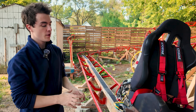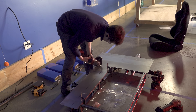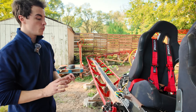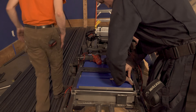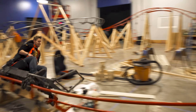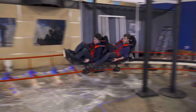One of the unique things about this ride vehicle is this very large center section. What's in that section is our four batteries that run the ride vehicle. Batteries are one of the heaviest parts, so we want the load to sit at the lowest point possible to ensure a low center of gravity. We have four batteries — they're 72 volt, 20 amp hour each — which means they can put out roughly 14,000 watts of power. That ended up being so powerful that we only use three of those batteries because they just instantly do a burnout and it's too aggressive. It's a nice problem to have where it's too powerful for the application.